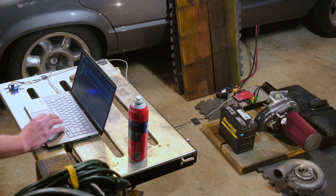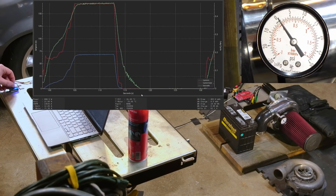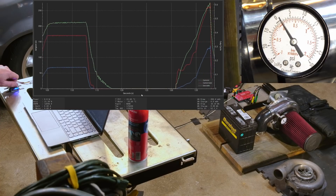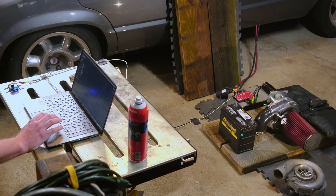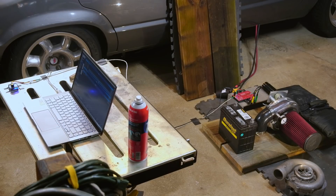We're at 120 battery current max. Let's go to the real-time data and hit the throttle. The VESC saw a fault — it saw a fault at 260, well 270 amps. Not sure why. I think it's because it hit the battery current max limit, so I've raised that to 200 amps.